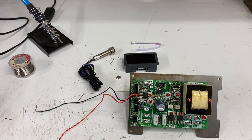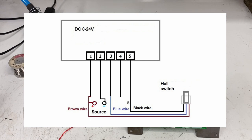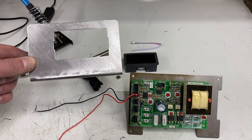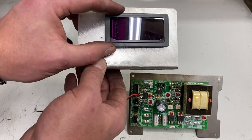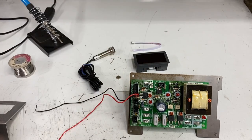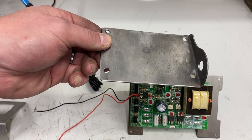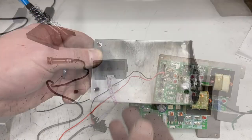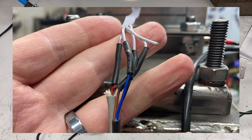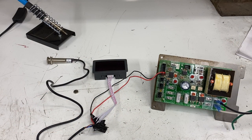The hookup is very simple. There are lots of schematics online showing you exactly which wires go where. The only other thing you need are some brackets. This is the bracket I fabricated to house the RPM gauge itself — it's going to snap in, and there are holes in the bottom so it can bolt to the top of my lathe. This plate goes on the back of the lathe to hold the hall sensor. I have it roughly wired up, with wires twisted together and electrician's tape to prevent shorts. For the final install I will solder each connection and use heat shrink tubing for a solid connection.